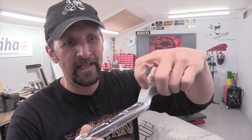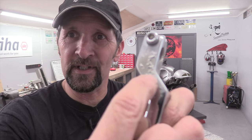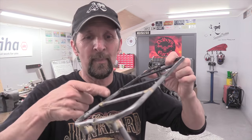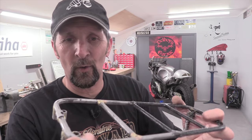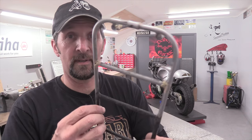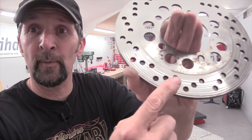I was really hoping I could blast the chrome off this gear shift, but I'm afraid not — it just laughed at me. The one little square inch I did, laid it on for ages, all it did was take the silver off down to the yellow — I guess the nickel underneath — but it didn't remove it altogether. On this rack I used it for paint removal. It did take the paint off, but it wasn't easy or quick — it took a long time and hasn't got it all off. The paint is probably Hammerite, so you probably don't get any harder than that, but it did still take 99% of it off with persistence.